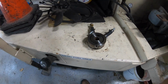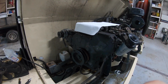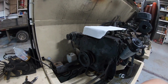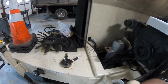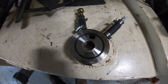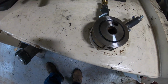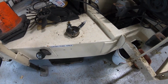Oil pressure is normally around anywhere from 40 to 80 pounds. And coolant, it's only like about 15 or 13 pounds. So the higher pressure is going to override. So that's why we thought, okay, oil cooler makes sense. So we pressure tested it. Made this little rigmarole up. Dunked it in a bottle of water. Didn't see any leaks anywhere. So we're assuming that's good.